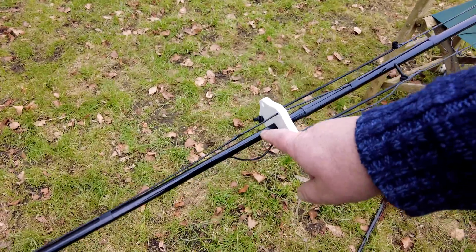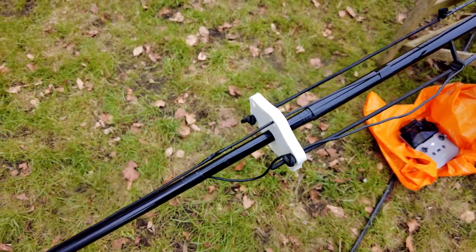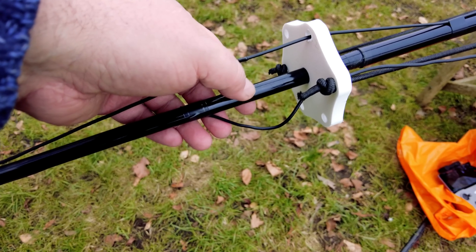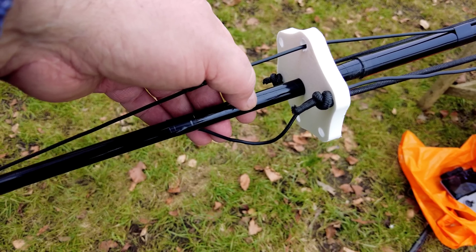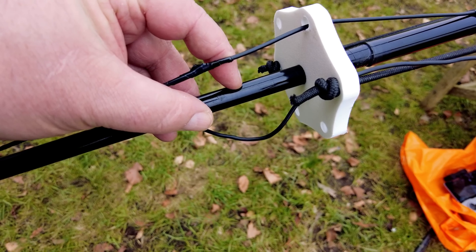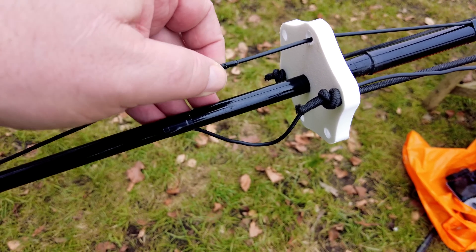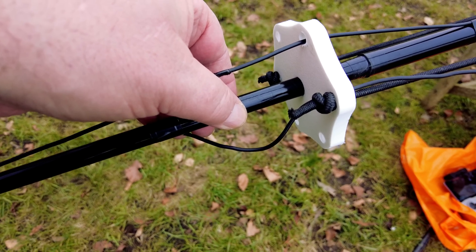There's a trick at the very top spreader: it is possible to tune 15 metres independently of 40 metres. I tested 30 micro-turns here and that can drop 21 MHz down to 19 MHz. So if 15 metres is a wee bit high, two or three turns here will drop 15 down a whisker and almost leave 40 where it is.